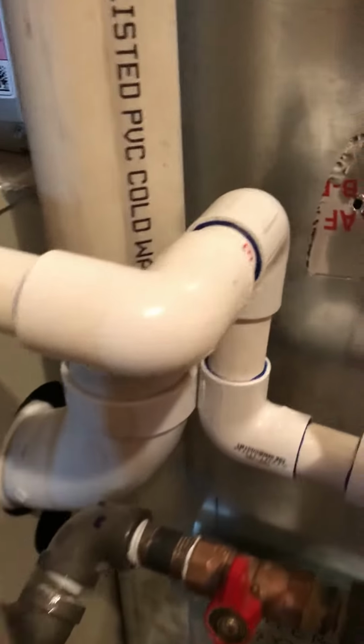So I said replace all the venting from where that silicone union is. And then I have to rework the gas line just to fit the new drop, because it's about 3 inches difference, and we're adding another 4. We'll put a new shutoff on it and new everything into the unit.